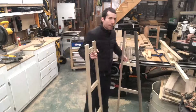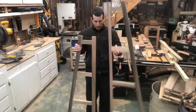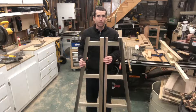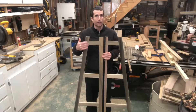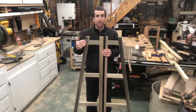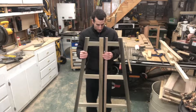I did the same on the other frame — started my connections on the narrow one and worked my way down. Pretty easy build, really, if you have all the measurements I'll give you. There doesn't even have to be a lot of waste, because when you're cutting this ten-degree angle, if you just flip the board there's no waste — you can use the angle off the other piece you just cut. You will have to do 90s as well, but that does help cut down on some waste.